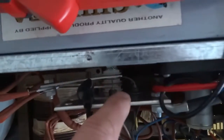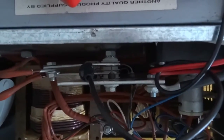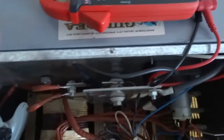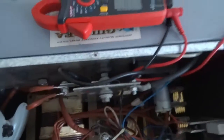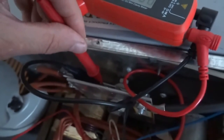In this bridge formation it converts AC to DC. Basically these diodes are like one-way valves - they should let electricity flow one way but not the other. To test them you put one lead on one side, on that stem of the diode, and then touch the phase plate. That allows electric through that way.